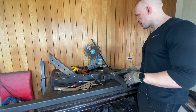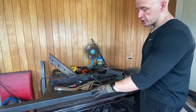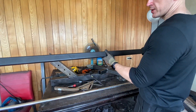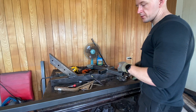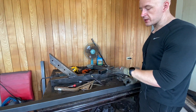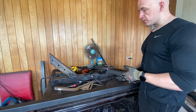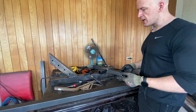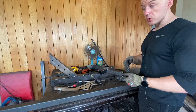To show you what I'm doing here, this is going to be the cable machine. It's just the same 2x2 square tubing I'm using for everything else. And because I'm using a free weight plate-loaded design for this machine, that actually gives a lot of advantages. One of the advantages is the fact that I can put as much weight as I want in any kind of increments that I want, and I don't have to rely on what's already on the stack, either on the low end or the high end.